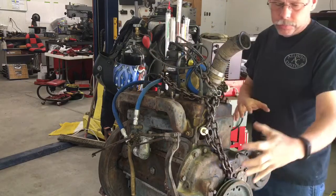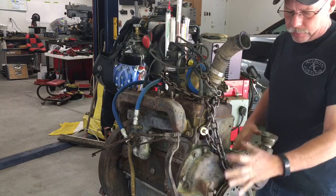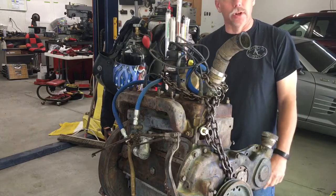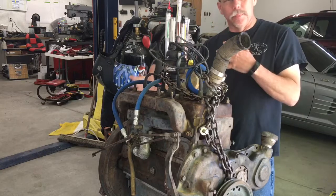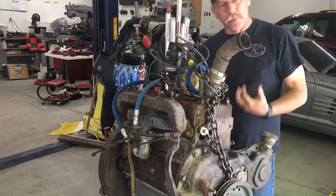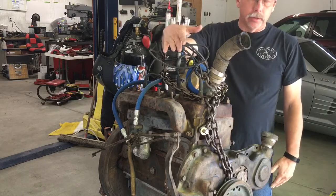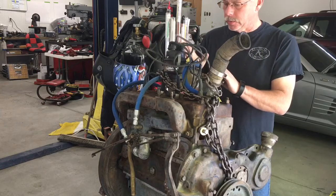The difference when it works in my forklift is this front drive area is a big gear drive driven off the crank to run a hydraulic pump. And then of course mine is a standard transmission, so it's got a clutch. So I've got a big bell housing that stays in the forklift, and then you've got this adapter plate on the back, but it's a real compact four-cylinder engine. Mine has got points type distributor drive, and then mine runs off of propane, so it's got the regulator and all that for that.